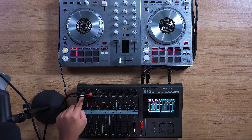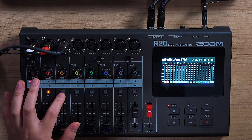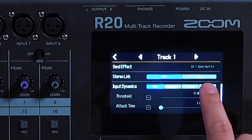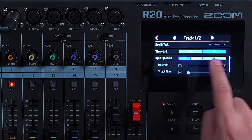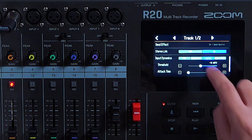The output of this is actually going to my other mixer, which is connected to my computer via interface, so everything this outputs can be streamed. I have channel one and two set as the output from my SB3, and I'm going to arm channel one, channel two, and channel three, which is my microphone. I'll click channel one and set it for a stereo link, which will link channels one and two as a pair. I'm also going to set the limiter and set it to minus 10. There's an input dynamics option — you can keep it off, set it to compressor, limiter, or noise gate. I wish this was actually a chain where I had noise gate, compressor, and limiter and could control each one, but it only lets you pick one or have them off.